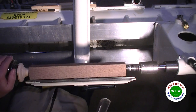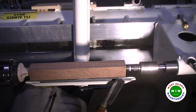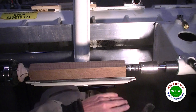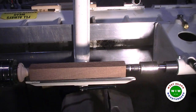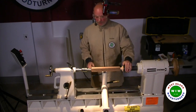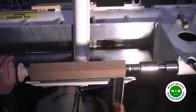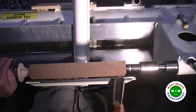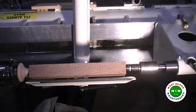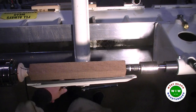And the reason that's good is because if you just went in there, even if you went in there at an angle with this, you can get really big chip outs. It'll take the corner off for, you know, two, three inches easily. Otherwise, you got to go in and start putting little nicks down the length of it so that you break it up. If you actually go in with it in this profile here, you can see that it just kind of takes a U-shaped cut out of the wood, and it cuts the wood instead of actually breaking off the corners. Okay. So with that, we'll see if we can.